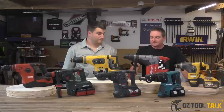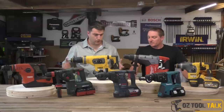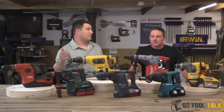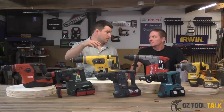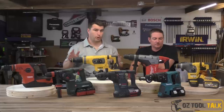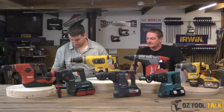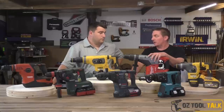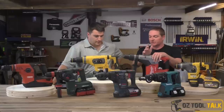A few notes from the testing: the 16mm bits are not identical between SDS Plus and Max — they've got a slightly different shaped head, which gives a slight advantage to the SDS Plus units, though they're all four-cutter bits. The other sizes are all identical — all Bosch Blue Extreme bits, which are awesome, so thanks to Bosch for providing them. Also, the Milwaukee has a two-mode only — it's not three-mode — so you don't have a dedicated drilling-only mode on this unit.